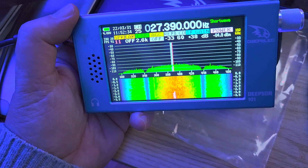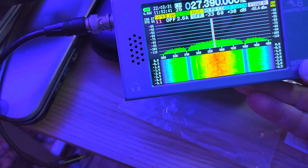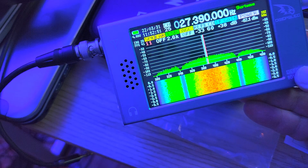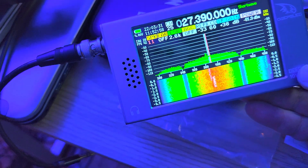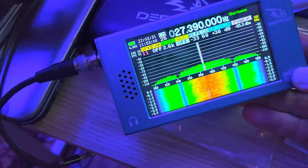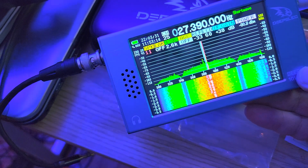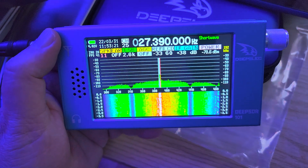So let's see, because I want to check out when using an actual radio, if we are tuned to the proper frequency. There's definitely some single sideband here. Let's try 27390. I'm going to have to use the other cables here. On the text it is on the frequency — so this is the correct frequency. They're really not good for 10 meters unless you go in there and tune them.